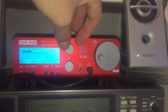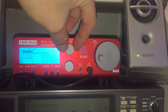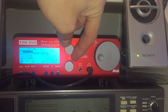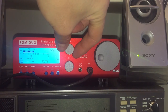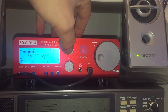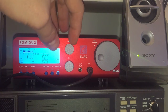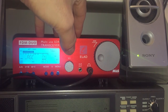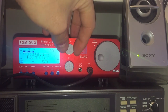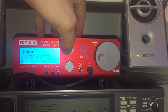E1's primary function is volume. If you press it, you've got squelch — squelch on — and then the actual squelch level, and turning it the other way switches it off. Press the button again and you've got the automatic gain control, which is off by default. Switch that on and it's set to slow, medium, or fast. Let's press it for medium.